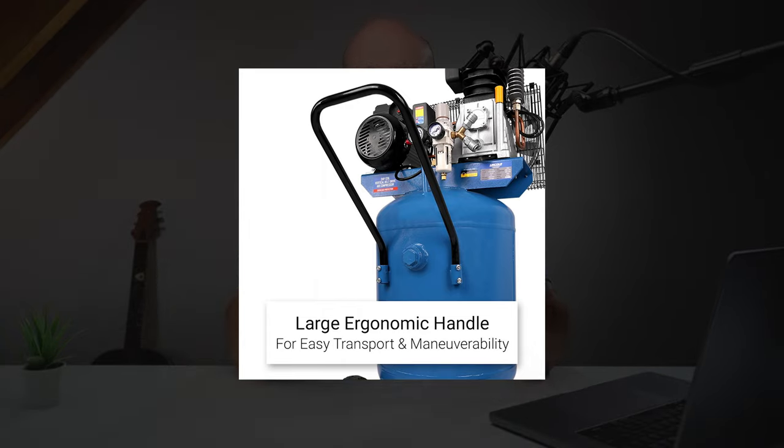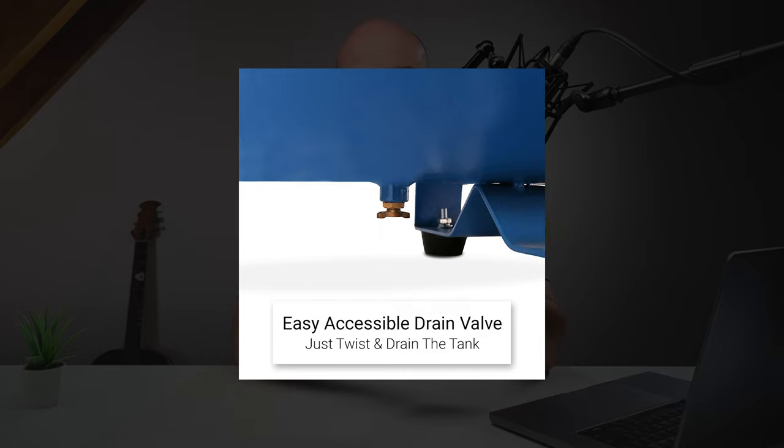I like vertical units because they take up less real estate — the footprint is smaller. I also find moving a vertical unit much easier. The bung on the bottom of the receiver for maintenance is more accessible on a vertical unit. Every now and then you have to release water from the tank by unscrewing a valve, allowing the water to be expelled — it'll be slightly rusty so clean it up — then screw the valve back in. On a vertical unit, the drain is at the very bottom of the receiver so you can more efficiently expel the water without losing much air. I used to do this once a week and there's almost no downtime.